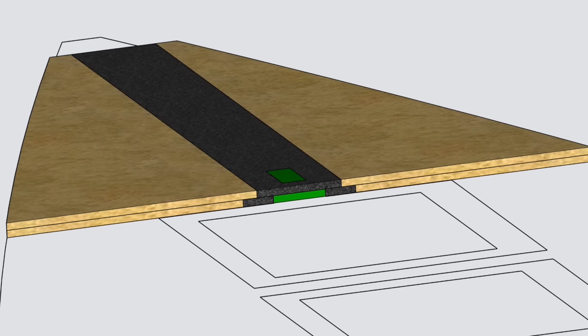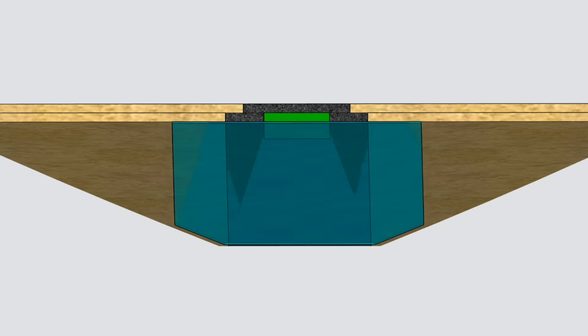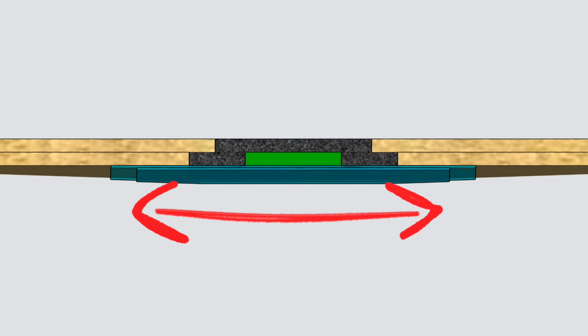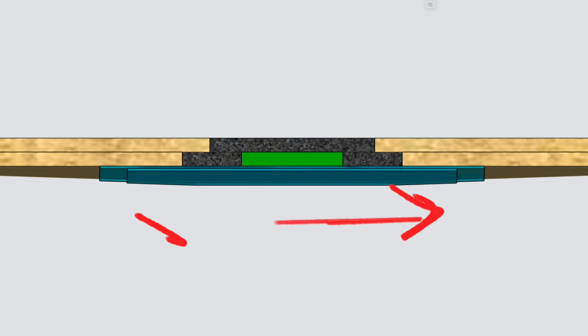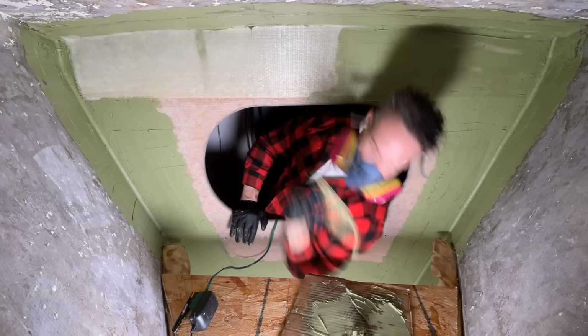Now I've already staggered these layers because there are two layers in this area to try to distribute these forces. I think what would be a really good idea though is to lay a couple extra layers of glass along that spine on the underside of that deck to further distribute that load, since the lower skin of this deck was on the thin side. Now recently when I was tabbing in this new bulkhead, I did put some fairing compound on some areas to avoid using peel ply. So maybe I've shot myself in the foot here a little bit, because now I want to laminate more glass to them. So I am going to have to smooth out and grind back some of that fairing compound so I can laminate a couple extra layers and then we'll be back to fairing and finishing.